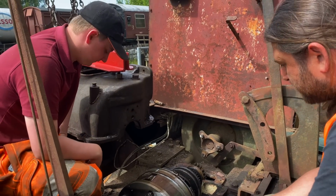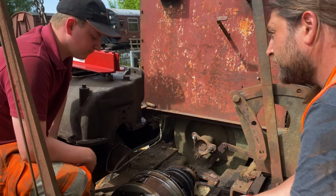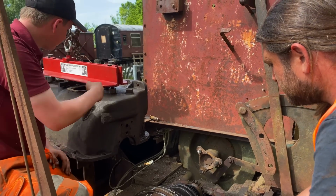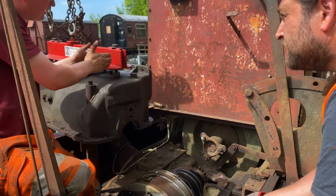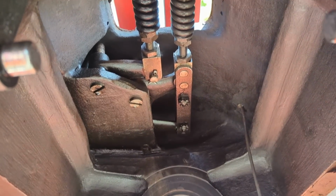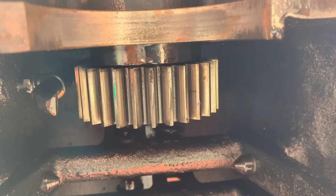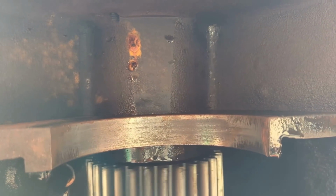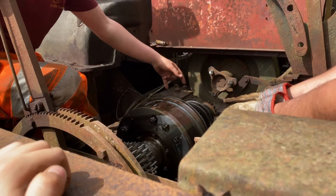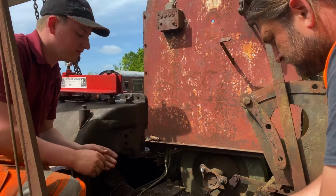I understood the system of the separate clutches, but I was expecting 3 separate mechanisms. I didn't realise it was all like one thing. No, it's all one thing. So the physical lever sits on here, and inside there's like a dog leg, 2 cams effectively. One's got first and second and the other third. That's what the big springs are in the top, and you can adjust the tension that pulling the plunger does, so you can go more pressure or less pressure. As they wear, you sometimes have to keep adding pressure, because obviously the friction material will wear down. It's just like adjusting a clutch pedal. You've just got to put a little bit more on.